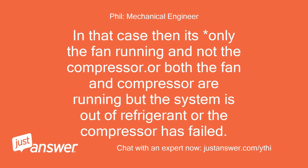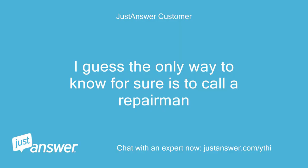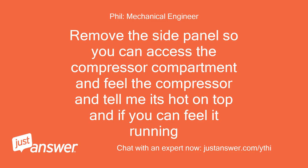In that case, it's only the fan running and not the compressor, or both the fan and compressor are running but the system is out of refrigerant or the compressor has failed. I guess the only way to know for sure is to call a repairman. Remove the side panel so you can access the compressor compartment and feel the compressor, and tell me if it's hot on top and if you can feel it running.